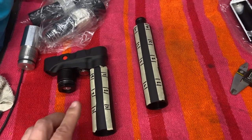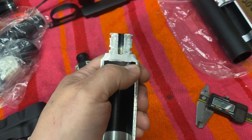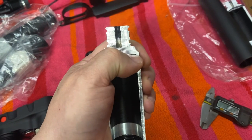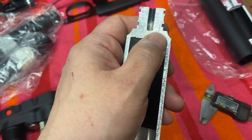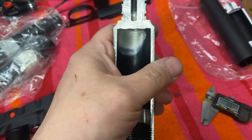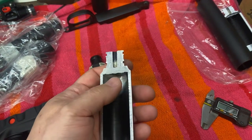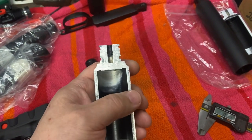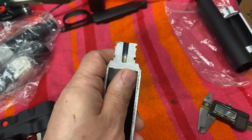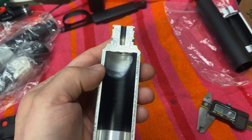But regardless of the outcome of this pressure test, the corner problem still remains in this. So it is yielding on normal pressure on the surface. Of course there's more material here, so it's not yielding all the way, but given time and the circumstances, using the gun, dropping the cylinder and all, it might lead to a failure. So this is something I don't like, this corner, and I have been talking with Ed about this, and yeah.